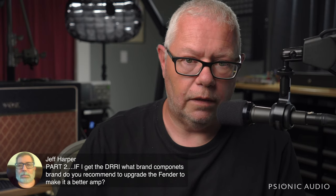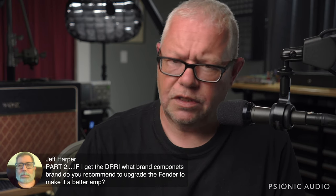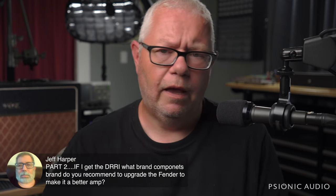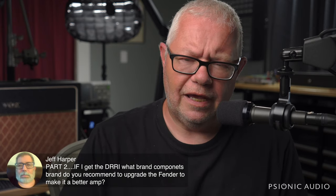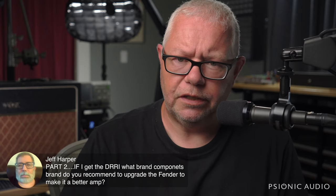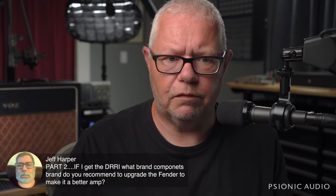If you have questions, a tech can answer them. Usually I tell you what I'm doing. The only real components I use to do those mods, I use a couple half-watt carbon film resistors. If I change a coupling cap on those amps, I like to use the Panasonic ECQ series. And when I move the screen grid resistors to the output tubes, I use the Vishay AC and PC series, 3-watt 470 ohms or 5-watt 470 ohms. You can also get those at tubedepot.com without having to go through Mouser or DigiKey or anything more complicated. They're just sold on Tube Depot's website as 3-watt 470 ohm low mass resistors. They're fantastic for that.